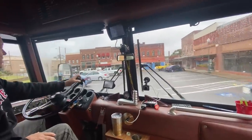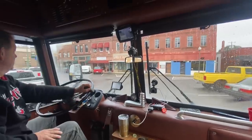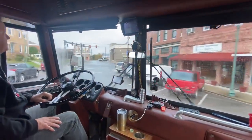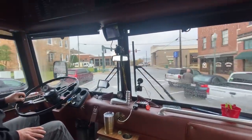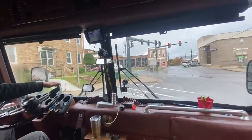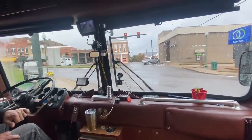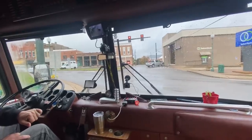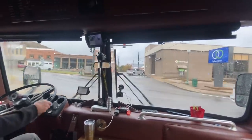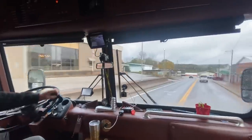Nice. Because you've been sitting for a week using your black tank, and sometimes you get that sewer gas smell when you drive. Yeah. That's been an issue. Every custom coach has that. I've never been in one that doesn't. But that's the P-traps sloshing around. P-traps work great in a house that doesn't move. But once you go driving down the road, the way they work is that water stays in that little cup.